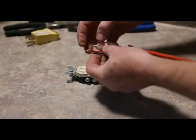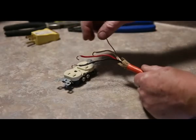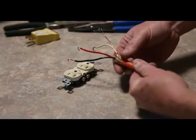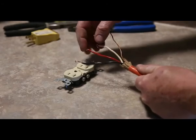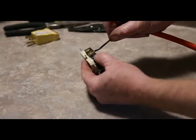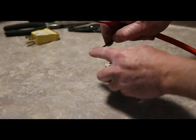Okay, I'm going to show you a typical kitchen plug. Now that'd be a lot easier just doing it on the counter here so you can really see what's going on. Now most people don't realize that on your kitchen plugs, you have two hot wires, the black and the red. This is a three wire system. Nowadays, of course, they just use a heavier gauge and are able to use just one breaker, but in this particular situation, each one has its own separate breaker.